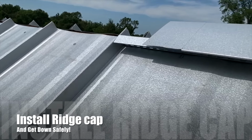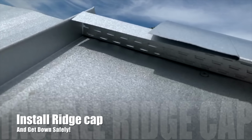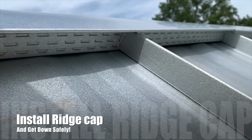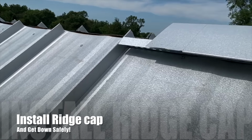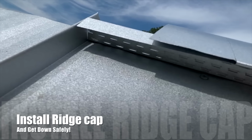And since the standing seams are 1.5 inches high, you're going to have a gap between each one of those panels. So right there, you're going to install a Z closure to provide a waterproof anchor point for that ridge cap to connect. It's going to allow moist air to escape, but it's not going to allow a lot of wind-blown rain to get up in there.